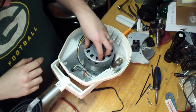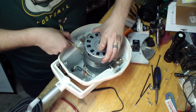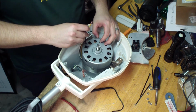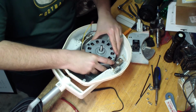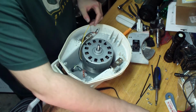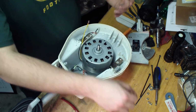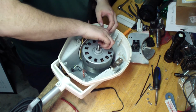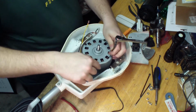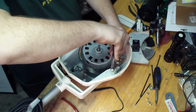So anyway, I took the bolts out that it came with. I'm gonna put those new ones in. And just look down here to line up the holes. I'm not going to put this one back in because that's what holds the eccentric in place when you tighten it. Let me get one in there started. Hey, right there, I got that one started. Holy crap, I actually got that thing lined up. I'll tighten these down. This is a cast aluminum piece, so don't tighten the ever-loving crap out of it. You'll strip the holes out, and that wouldn't be good.